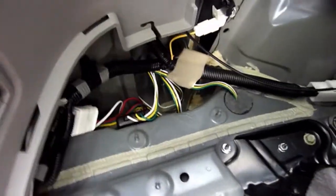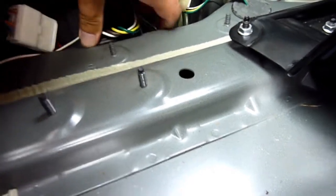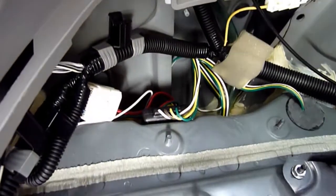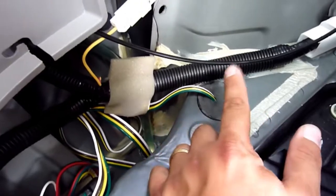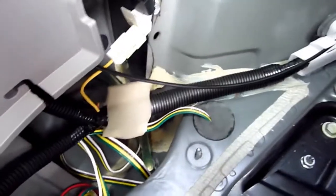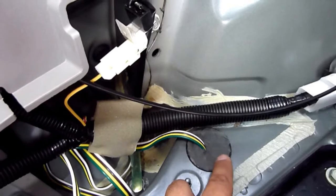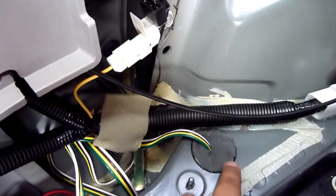Welcome back. You can see I've used the two-sided sticky tape and that's put on the side there. Hopefully I did it low enough that the basket is going to fit flush. When I did my duck seal I basically stood this wire up, put duck seal around it so when it lays down it has duck seal underneath it and isn't creating a gap. When you look at it from the underside you can't see any light — it's completely sealed. I basically just rolled it up, put it in the pocket that was there as a gasket and grommet, and kneaded it out to the edge so it gets a nice good seal.